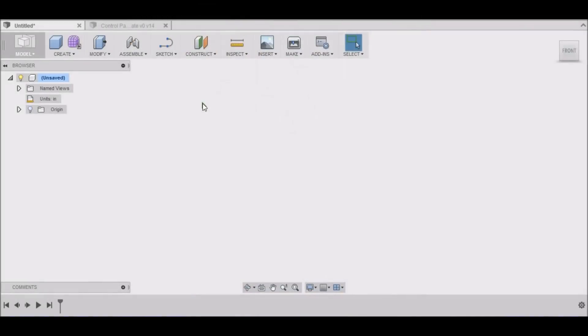Today we're going to be using Fusion 360 to draw our control panel faceplate. This will be mounted to the side of the top touchscreen monitor. I'll have my power on button, my e-stop button, a spindle lockout switch, a switch to disable my coolant, a switch to turn on the computer, and also an accessory jack for a touch probe or touch plate later on.